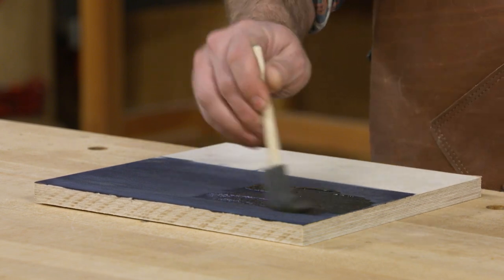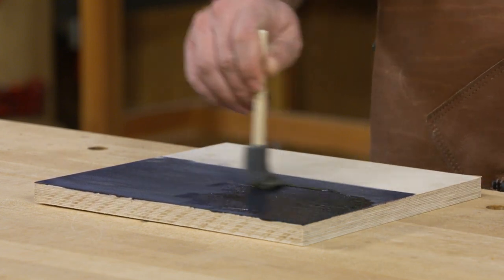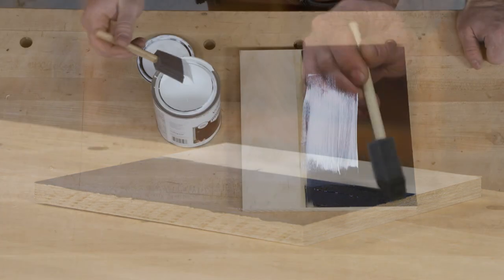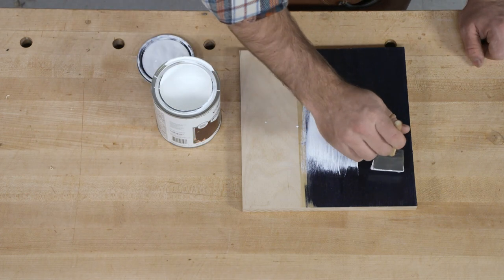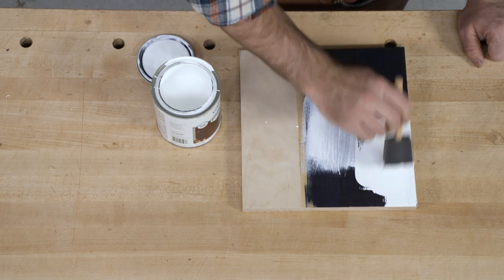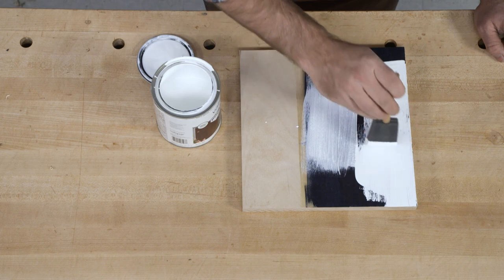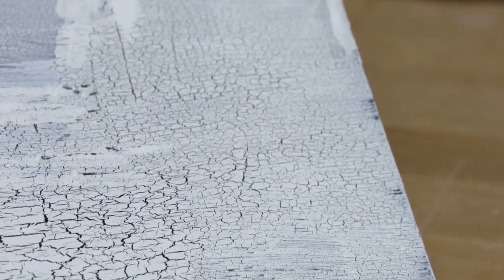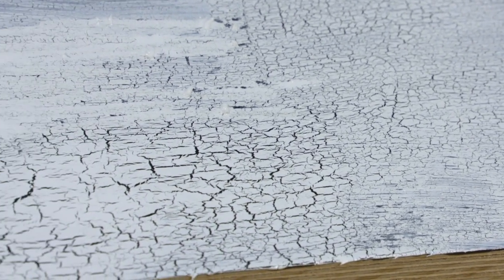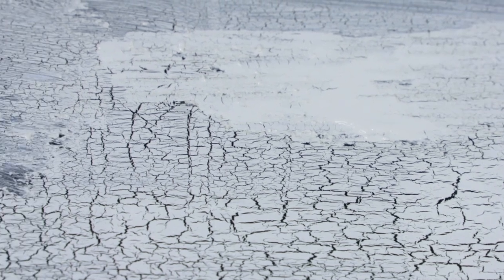You can do this one of several different ways — either paint your entire part with the hide glue or just paint the areas you want crackle. After the hide glue has had a chance to dry, come back with a top coat of paint in a contrasting color — something like white or light yellow. Anywhere that top coat goes over the hide glue, it's going to create a crackle effect, and you'll see that top coat start to crackle. You can play with the effect by adding more or less hide glue in certain areas to get bigger or smaller crackles, and really selectively apply it in those areas.